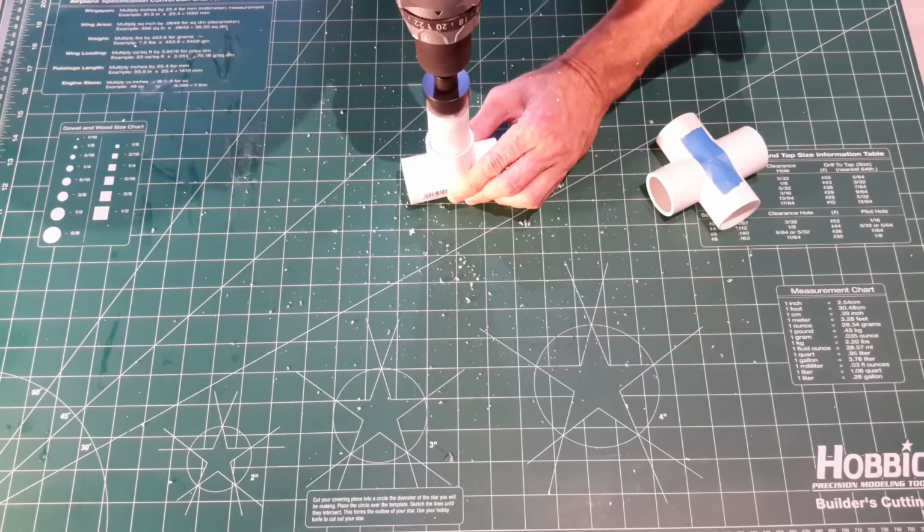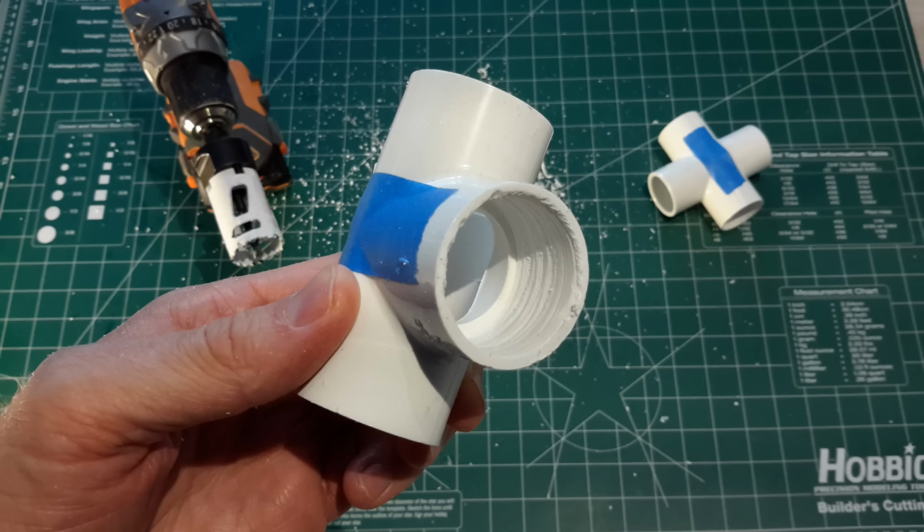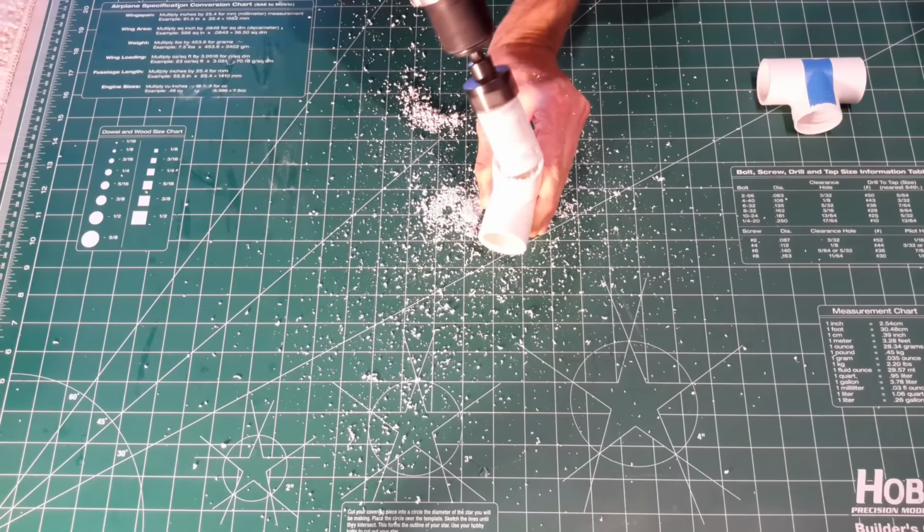Run it through in reverse the whole way up until you get to the stop. You'll see here in the photo there's the before, and then the after shows that I maintain that stop, and that's where the pipe or the axle will stop inside the frame. You don't want to go beyond that, otherwise you'll run into issues with the pipe eventually wearing through that T.